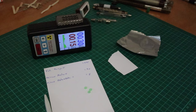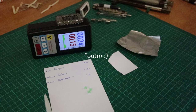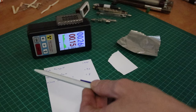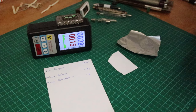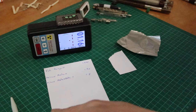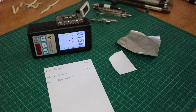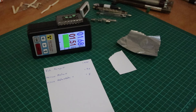Let's do a very last test before we wrap up: a quick alpha/beta/gamma sensitivity test to show how the SPT11A actually picks up alphas, betas, and gammas. I'll take three tiny uranium glass beads and place them directly on top of the sensor. We have an average of 0.15 right now. I'll restart the average calculation — it takes about four minutes to stabilize. After waiting, we have a full-range baseline of 1.51 microsieverts — not true microsieverts obviously, but good enough for this experiment.